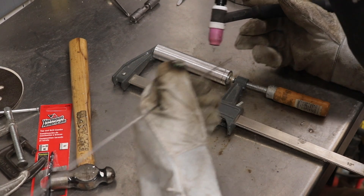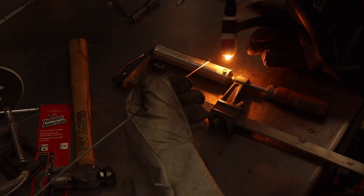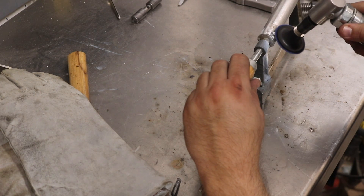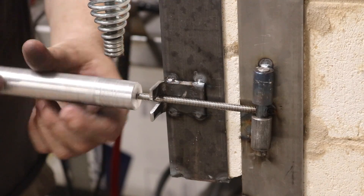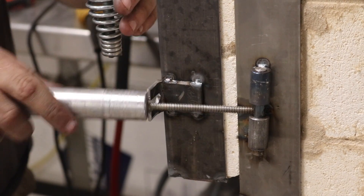I squared up a tube and made a plug that fit into it. I was going to weld these together, and when I went to weld them I had a really awful time. After being really frustrated, I figured out that I never turned my argon on — I was mostly focused on getting my AC settings correct. I ground that up and then had a relatively decent time welding it — good aluminum practice. I still ground them down just so it would be a little more even, and then paint will cover the rest of those sins.